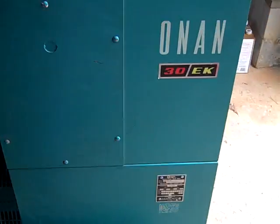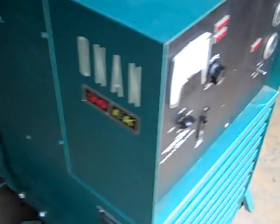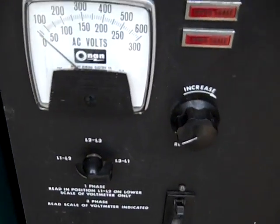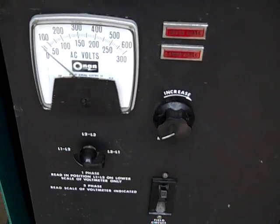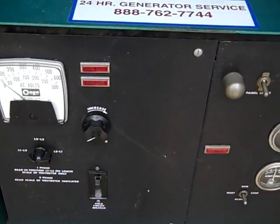And we are going to hook this baby to the Victory Gas Works gasifier. I've got it rewired — this is a 3-phase and single phase generator — I just got it rewired for single phase. So it makes about 20,000 watts, and I just put a new voltage regulator board in it, so it's ready to go.